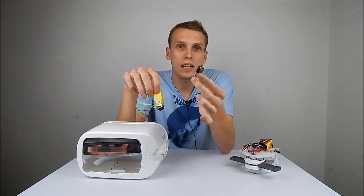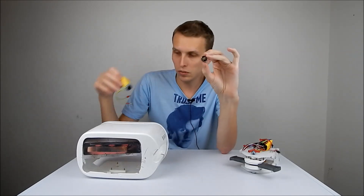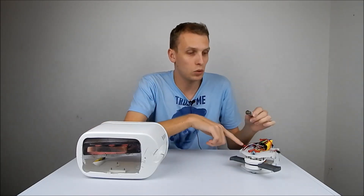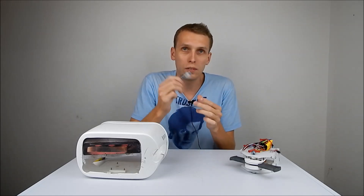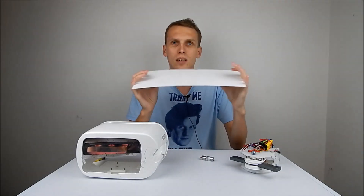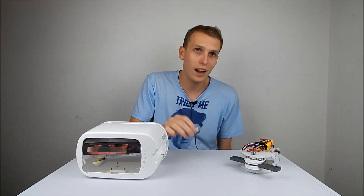Today we're going back to these motors, which are like a knockoff silver spark motor. I've used these before in the drum spinning robot and they shattered. So this time we're going to belt drive from the motor output to the wheel, so there's no direct force on the motor. I also think I'll use high impact polystyrene board to mount these to the chassis so there's a little bit of give in it — at a smaller scale it has a little less give, but that will help protect the motors a lot more and hopefully mean I don't lose drive this time.